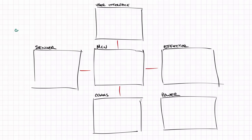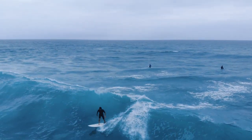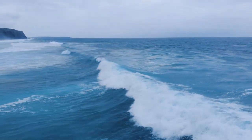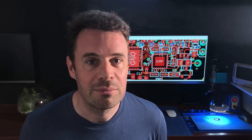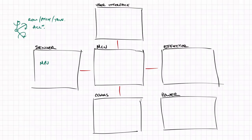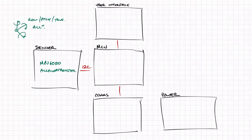In this case, what we want to do is measure the attitude or relative position of the board as it goes through the water. The exact location is not important, but rather how the board moves through the water is. Fortunately, there's a sensor called an accelerometer which can measure all of this, and you have one on your phone. I did think about using the accelerometers in a phone by attaching it to the board, but whilst that might work on a snowboard, I don't think it'd work on a surfboard. I've used the MPU6050 before, so I'm going to go with that. There's heaps of support for it, and you can sample it thousands of times a second, much quicker than I need to.